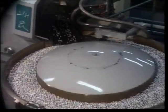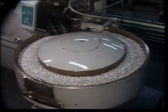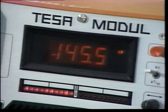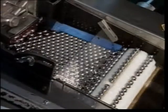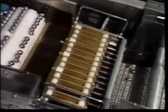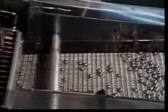After undergoing heat treatment, they are repeatedly polished with a grindstone to a mirror-like shine. Then, after each is determined to be spherically precise, they are sorted by diameter to within plus minus 1/1000th of a millimeter and delivered to various assembly plants.